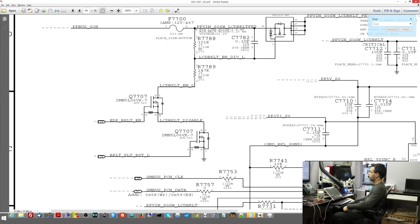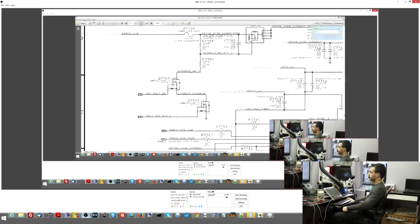A voltage divider is going to go between the high side power source and where we want the power to go, and then where we want the power to go in ground. But unfortunately, there's this little crap in the way over here. This transistor sits in the way of the bottom of this voltage divider and ground.